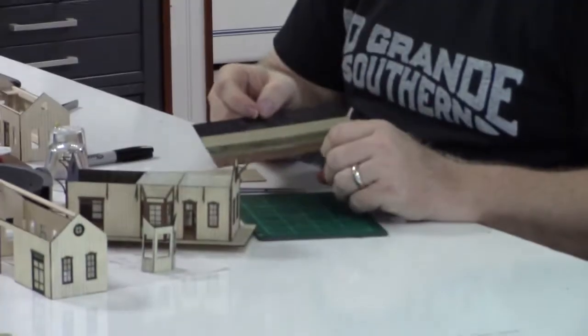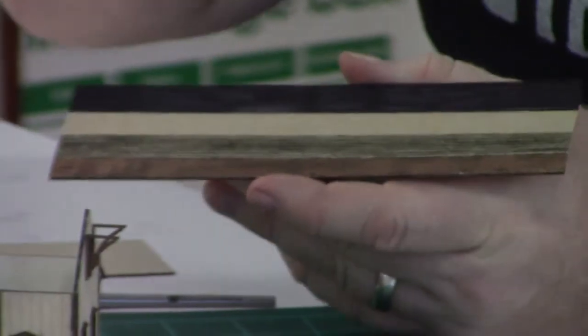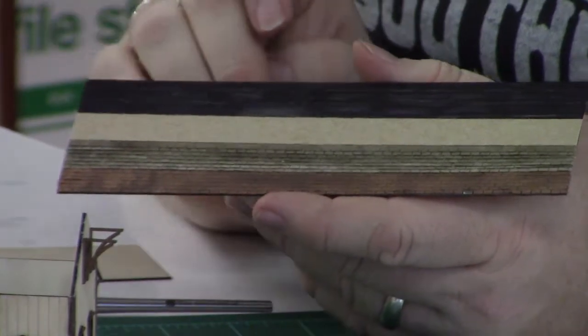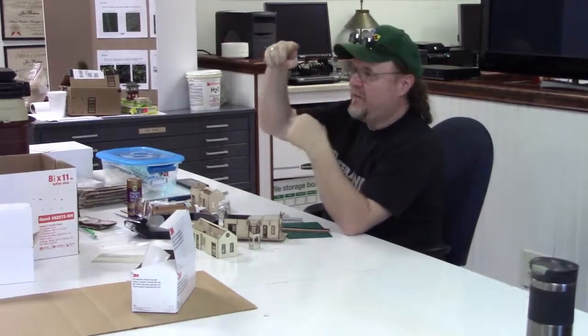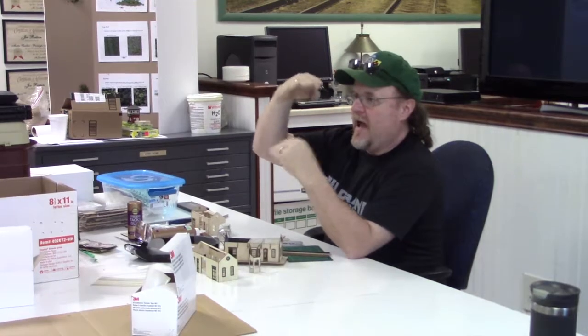And I've already got some shingles on this. If you zoom in real close, you can see. And I've been playing around with some colors and things. And I found something on this that you're going to want to do before we start putting any shingles down. Take the same Sharpie, and if you've ever seen a shingle, it's about 3 feet long, each tab's about a foot, and vertically, you've got colored granules on what's going to be exposed about halfway up.